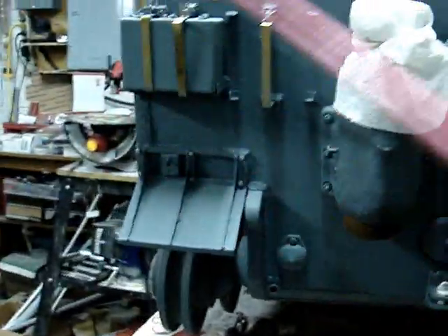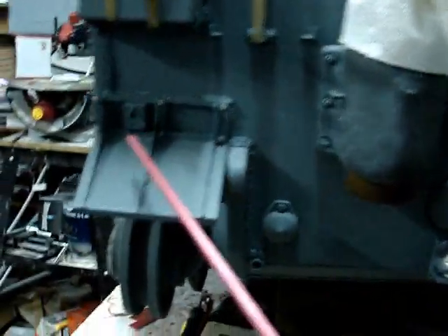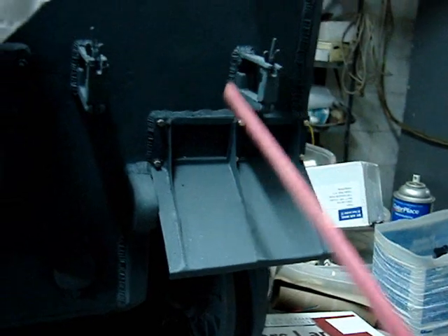Let's start with the tank's rear plate. We can see that pretty much all of the detailing on the rear portion of the vehicle is now complete. This includes the sheet metal fenders, which are the initial type. The fenders themselves are scratch built out of sheet metal and are all soldered together.